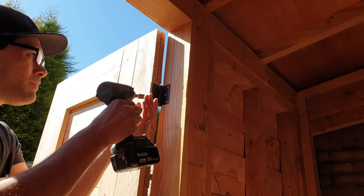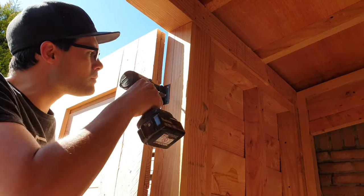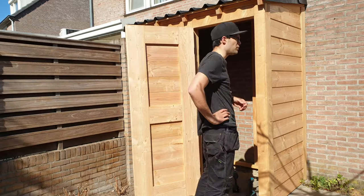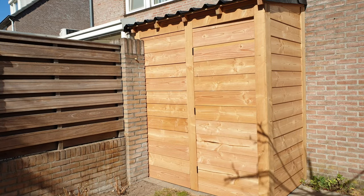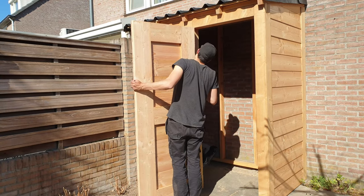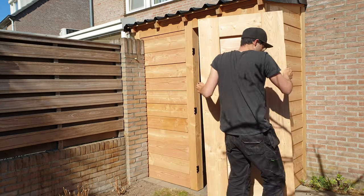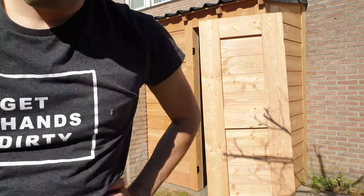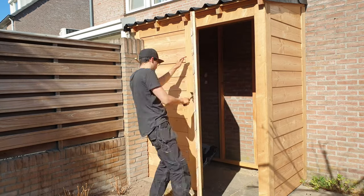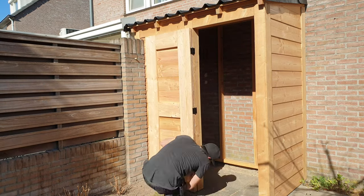A few things didn't quite go as planned. After I had made the mortises I hung the door from the top hinge. Trying to get the other ones to fit the mortises seemed impossible. For my second attempt I attached one part of the hinge to the post and one to the door, leaving only the pin over to put back in. This solution had some potential, but the problem was there was no room for the pin to slide in next to the post. In the third attempt I made some room on the post with the chisel so the pin can slide in, and I used the hammer, which did the trick in the end. I don't recommend this solution, but the door is in and it works.